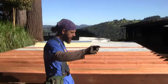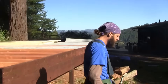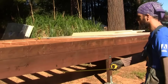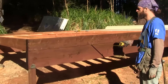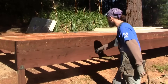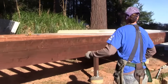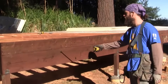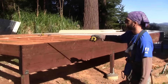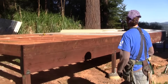Let's walk around to this side and look at the beams we created here. This tiny home is a little bit overbuilt — we chose to use 2x12 beams and then a 2x8 joist on top of that, so it's incredibly structurally sound and will never bow or bend. You could probably do a 2x10 with 2x6 joists for the span we used. The building is 16 feet wide by 27 feet long.